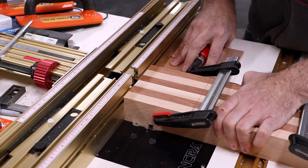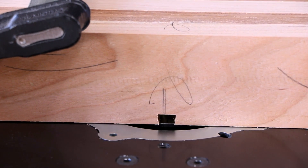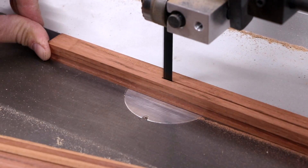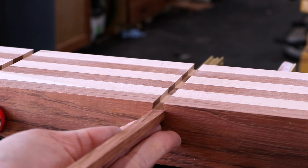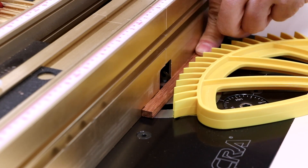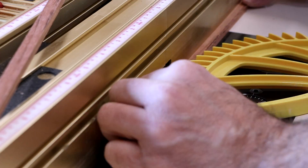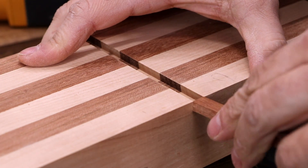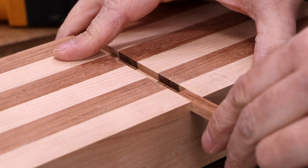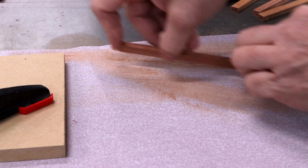At the router table, I'll use a dovetail bit for the final slots. The dovetail key will be cut from some flooring off cuts. The width is the max width of the dovetail slot and the thickness is the height of the slot. This piece is pretty small so it's important to use a feather board and do whatever you can to keep your fingers away from the bit. The great thing about a sliding dovetail is that you don't need to adjust the height of the bit for the second cut — we'll just dial in the fence position until the piece fits. It's just a bit too snug so I'll take a few passes over a piece of sandpaper on the table saw.